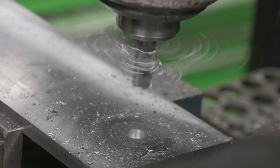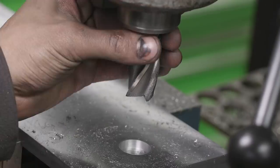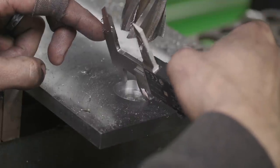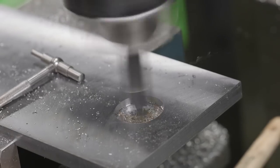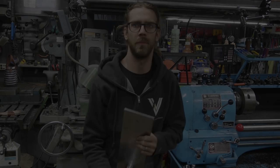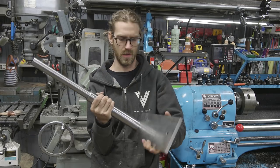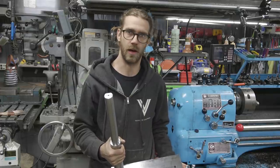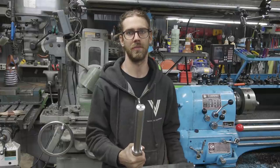We're going to start to drill that square bottom hole. I'm using a 5/8 end mill to start, then switching out to a one inch end mill. The goal is to enlarge the hole as large as possible so that I'm not spending forever boring it out. We get it to about an inch and an eighth, then switch over to the boring head and dial in the last amount, taking about a ten thousandths pass maybe five to ten times. We finished up that last plate and got it pushed onto the shaft — it's a real tight press fit, probably about a thousandth, maybe a little bit less. Everything's good on this piece. We just need to make one more piece that telescopes on top of this steel plate, and we'll be making that out of aluminum over on the mill.